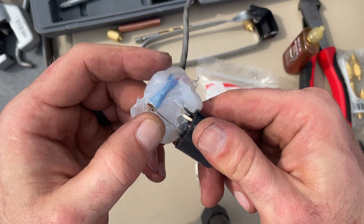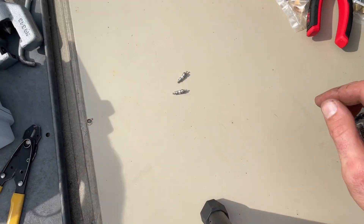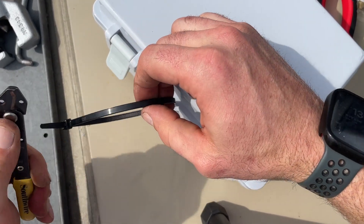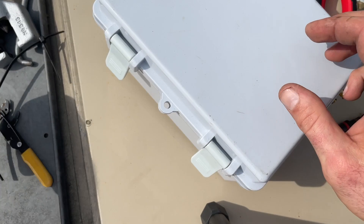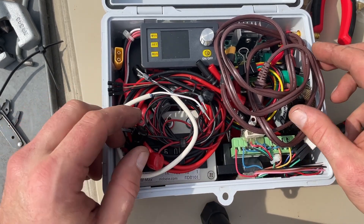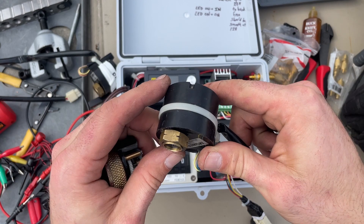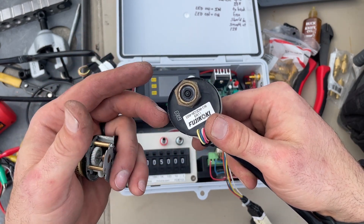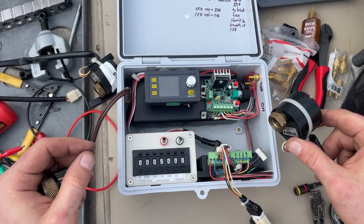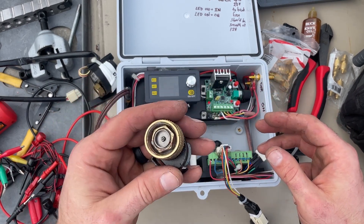The category of this repair right here is: you've got to do what you've got to do. Good times. Let's make some space here for the EEV tester — I have not shown this on a video yet. I've got a zip tie on it because I was carrying it up a ladder. Ta-da! This is not a bomb. Here is a Daikin VRV coil — it's a stepper motor style EEV coil. And this is pretty much interchangeable with LG, but they do drive differently. This is homemade, obviously, and it allows me to test pretty much any sensor or anything like this on a VRV system.